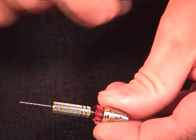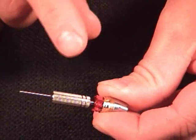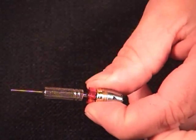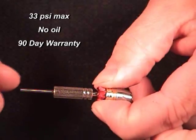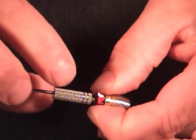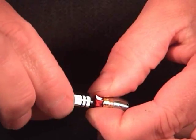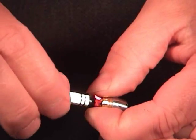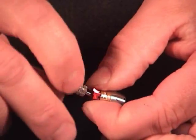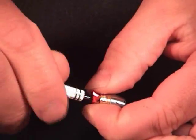So now we have our tool in the back of the turbine in the slots. Next thing we're going to do is just hold the red anodized rotor on the back of the turbine with our fingers and we're going to turn our wrench clockwise — these are left-hand threads, so normally tightening — but this is going to loosen it. So we're turning the nut clockwise until we feel it release.